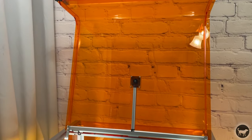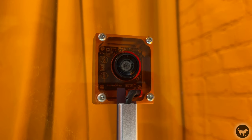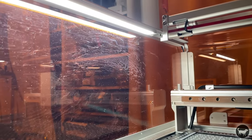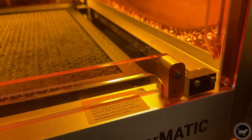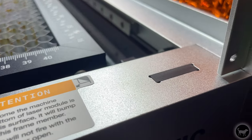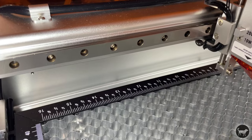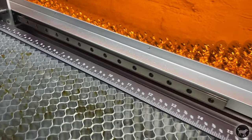On the top of the machine, just like in the original, there is a camera that can be used in Lightburn to take an image of your work area and place your designs directly onto those pictures to help line everything up. Mounted on either side again are two LED lights to help with seeing everything that is happening with your jobs. On the front of the enclosure are upgraded switches for the safety feature of turning the laser off when the lid is open while in use. Before these were limit switches that might have been slightly off, and now they seem to be some sort of more reliable inductive switches. The gantry that the laser moves on are linear rails for some nice, fast, and accurate movements. The machine can operate at up to 30,000 millimeters per minute, which is pretty fast.